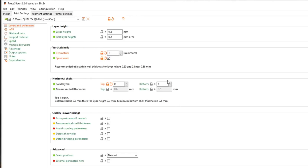The only thing you need to do in this section is go to your bottom layers and decide how many you need. I'm going to leave it at four because I like that extra weight in the base to hold it wherever it's sitting, so it's not a flimsy thing that flops around. A lot of people do two, but you really don't want to do one with a 0.4mm nozzle — three to four is probably the best.